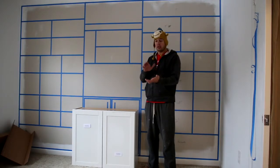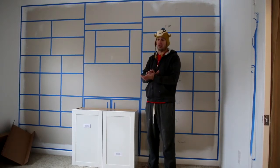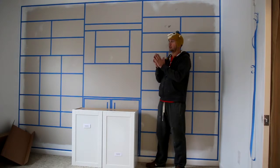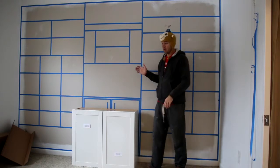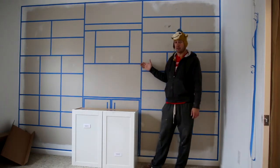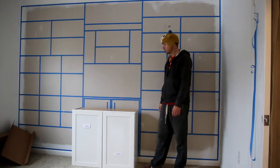But with that, the shelf is too long, and you leave a lot of space for dust, and I don't want dust. So my plan is to have them shallow shelves and the books either be right at the edge of the shelf or even stick out 1/4 inch or so. And I'm gonna use false backs to basically push the books to the edge of the shelf.